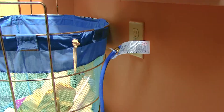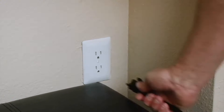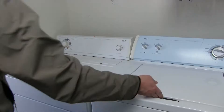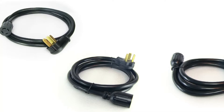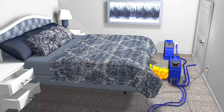This is because it's possible for two rooms to share the same circuit. It's also a good idea to unplug all the other electronics in the treatment room and power off the electronics in the other rooms where you plugged in the blue cords. If you have a 240-volt appliance in your home, you can use the power distribution kit to make things a lot easier. This kit will step the 240-volt power down to usable 120 volts and gives you a total of four 15-amp dedicated circuits, making it easy to fully power an Elite 4 or power half of our other heaters.